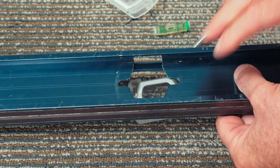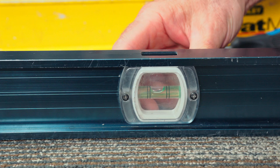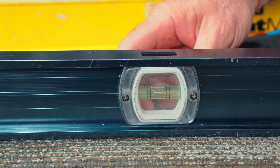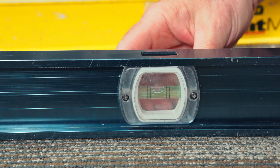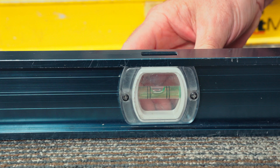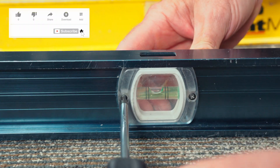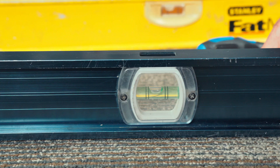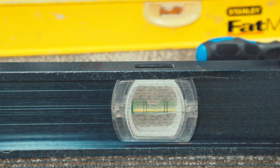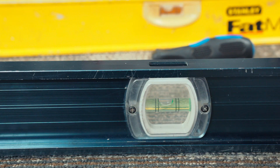Just take that apart — you've got your little bubble in there. Clean out any kind of crumbs or gunk that might be in there. When you put it back, leave the screws kind of loose. See the bubble moving as I rock that back and forth? What you're looking for is the same reading no matter which way the level is facing. We'll tighten up the screws and flip it around. Looks like we're just touching the first line on the left — same the other way. Tighten it down. That looks about right. This one is fixed — very easy fix.